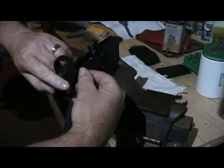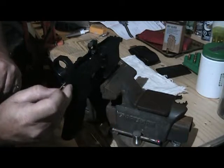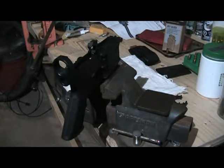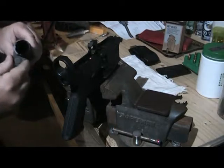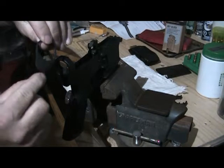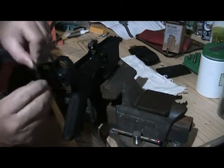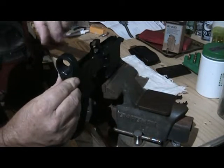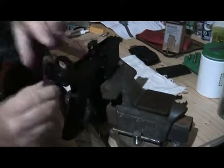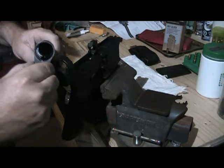Give a little bit of pressure, make sure it is in there properly. What I'm going to do is actually remove this spring until I'm ready to lock it down in place with the bolt. It's this end plate that will capture that spring in place — this recessed piece right here goes into this hole, locking it in place so it doesn't move. The tube will lock this in place and there is a guide pin right here which allows it to stay in place on the tube.